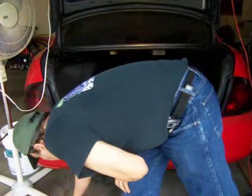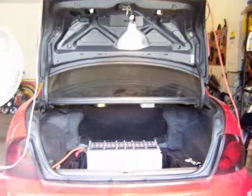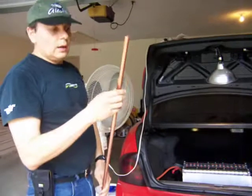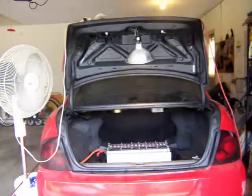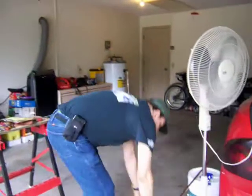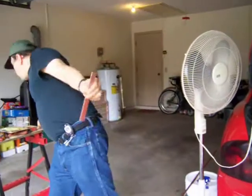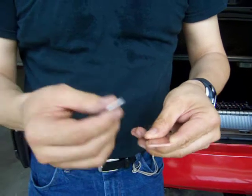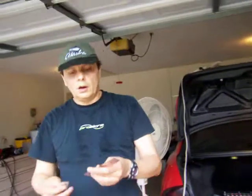And of course I can't use the original connectors anymore. So what I'm going to use to join the batteries is regular simple copper pipe. I cut it with a pipe cutter — it's really easy to cut — and then with a simple hammer and a few basic tools for car work, I just flatten it. Now this doesn't even look like a piece of pipe anymore. It turns out it's pretty much the same size and thickness as the original connectors. This is going to work really really great — you can't even tell this was a pipe anymore, unless you have a lot of imagination.